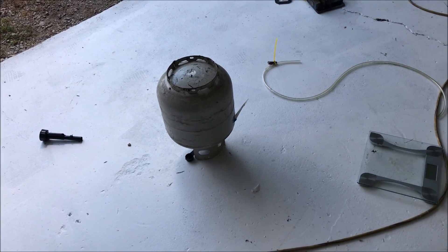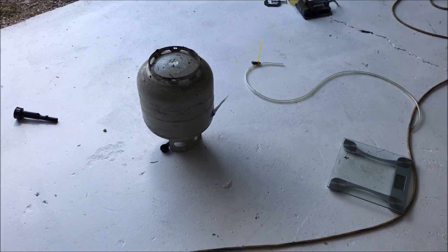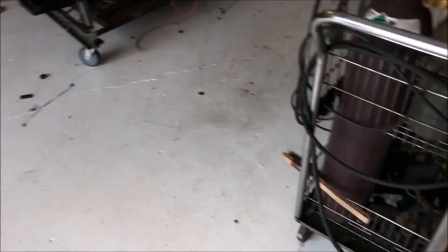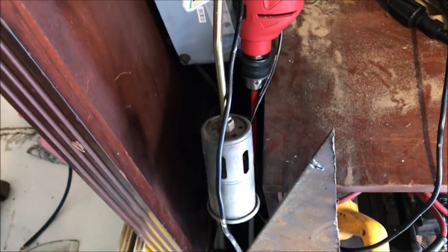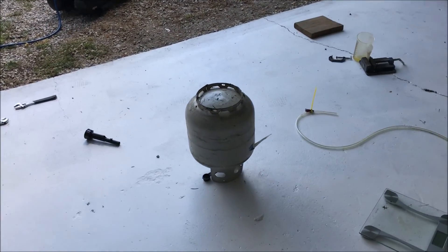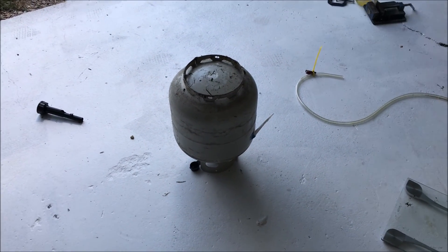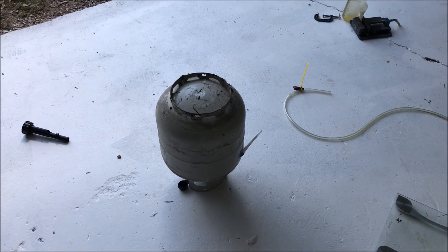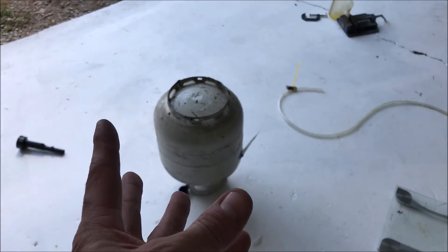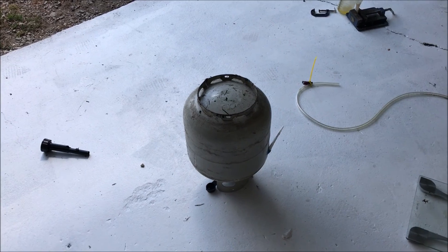And trust me, I know this because that's how I used to thaw off the job site when I was a carpenter in wintertime — I would hold the tank upside down with one of these torches here, and it will shoot a 20-foot flame out the front because it's spraying liquid propane. If we inject liquid propane into that burner, we wouldn't be using as much pressure in the tank. We wouldn't be suffering from the boiling effect. We'd be able to transfer a lot more energy in the form of a liquid.